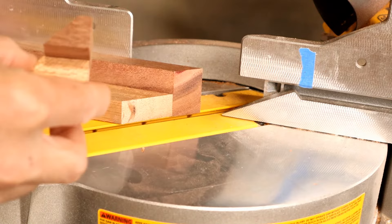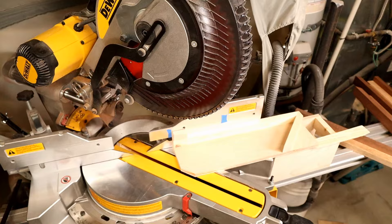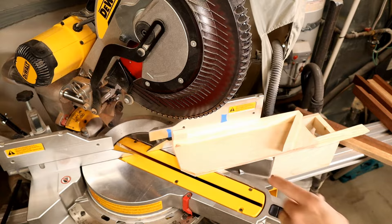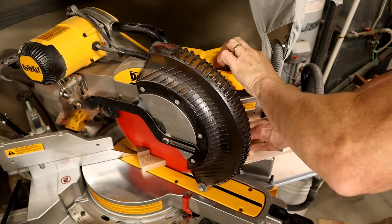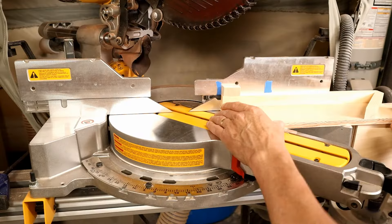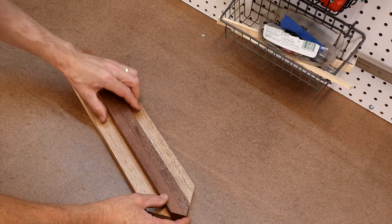You can see it cut less than a half an inch off. When you're ready to make cuts on the other end of the boards, it's important to have some sort of stop block or jig set up to ensure accurate cuts. Combining the jig I made with some tape markings on my saw fence, I get accurate, repeatable cuts. I start with the two short boards, then move the jig back four inches for the longer boards. Here's a way to check if equal-size boards are cut to equal length — put them corner to corner and make sure they're even.